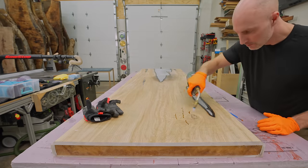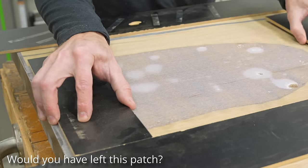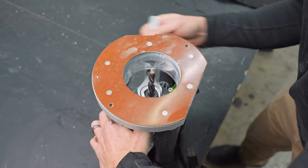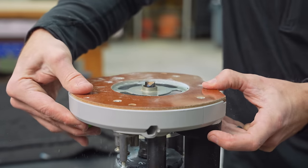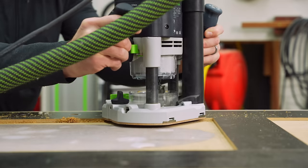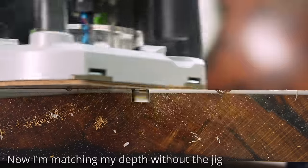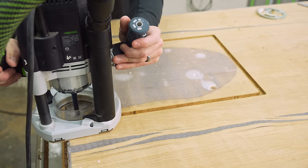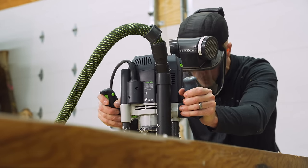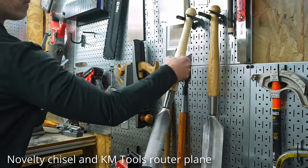The next problem I'm addressing is one where my 'think about it' logic almost won — I wanted to believe it looks smooth, it's filled with epoxy, no one will notice. But it actually looks really terrible. The right fix would probably be a CNC, but I don't have one, don't have room for one, and wouldn't know how to use it anyway. So I made a really simple jig, cut three straight lines, reset my depth, and hogged it out one strip at a time with the router. Probably took me 20 minutes total. I just need to clean up the edges.